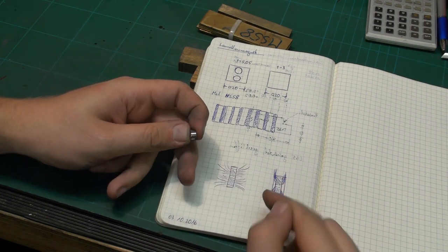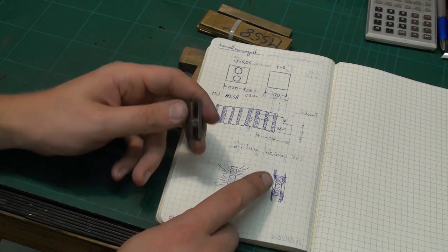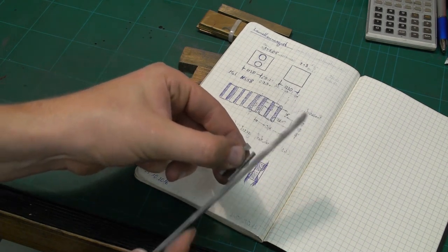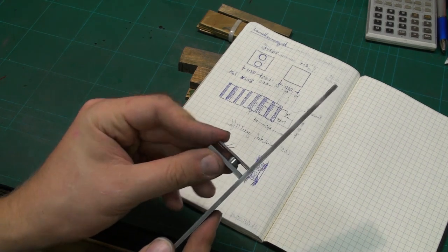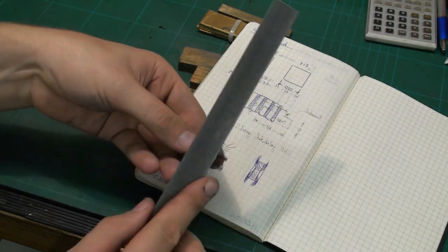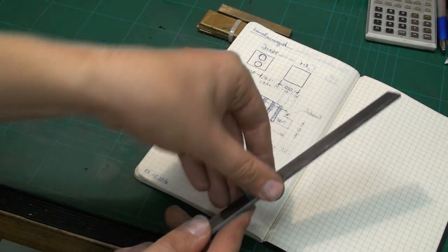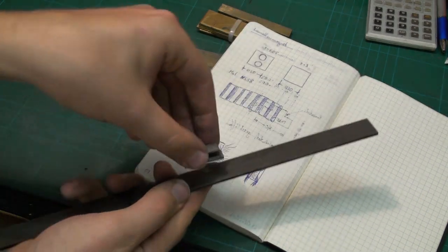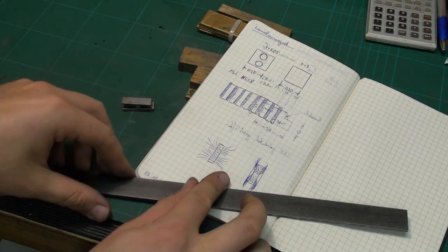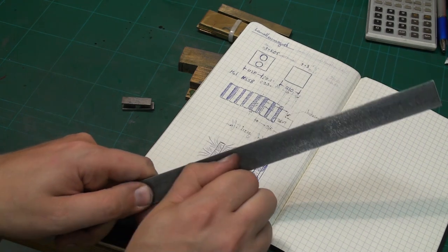But if we place a mild steel plate on the end of the magnet, on both sides of this magnet, the field lines don't go out the side anymore. Let me show you with this. See, almost no stickiness. But on the faces here, we get very, very high forces, even more on this side because the surface area is bigger. Almost hard to get it off. And on this side, we can barely lift the part. Opposed to the naked magnet, which in this orientation is almost very hard to get up without having to pry it off.